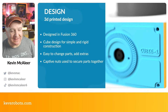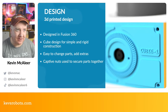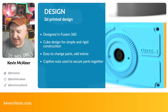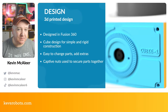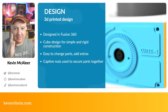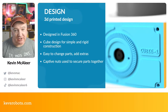I've gone for a cube design this time because it's a simple structure to design in 3D and gives quite a bit of space. One challenge in the past was making robots just big enough for parts with no room to spare — this cubey design has space for four or five battery packs. It's also a rigid design we can build as a series of flat sections, since a cube is just six flat planes. That means quick 3D printing and easier part exchange.